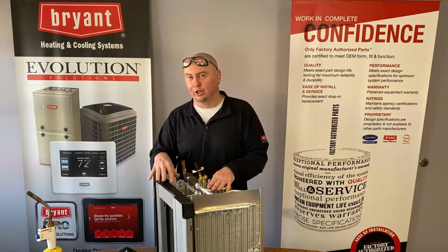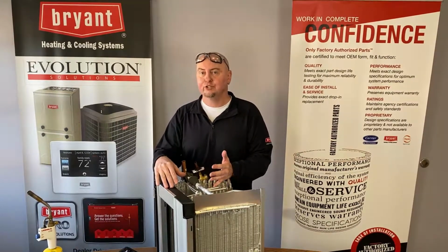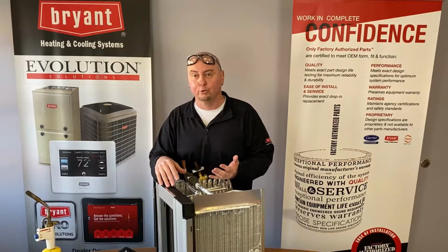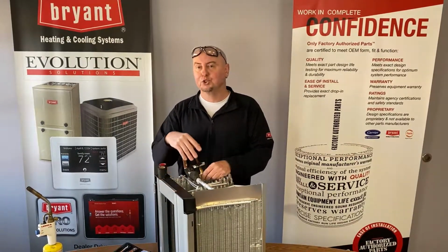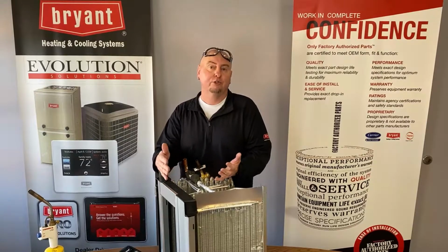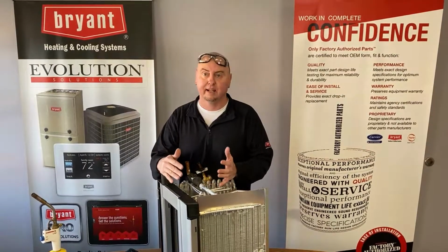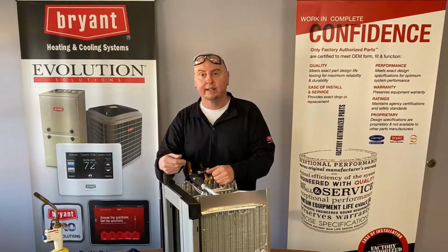I wanted to demonstrate a little bit today about aluminum repairing. Obviously, I don't think anybody's going to ask you to repair a warranty coil, but there's going to be a lot more aluminum coils coming out, whether it's on a condenser coil or evaporator coil. I would assume if the coil is under warranty, you would just replace the coil, but there are some that you can repair. If it's a Friday night, Saturday night, Sunday night, something like that, you can make an aluminum repair and get the unit back in operation.